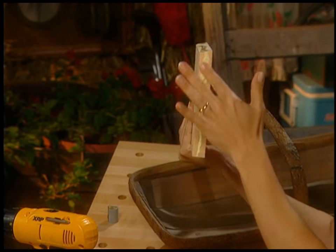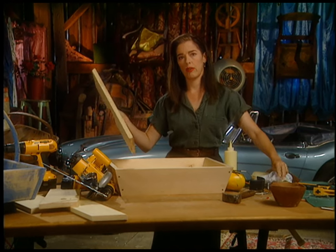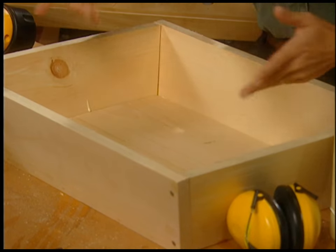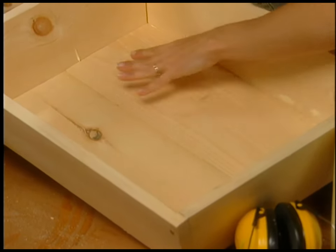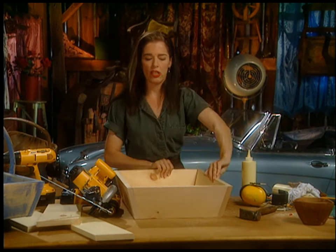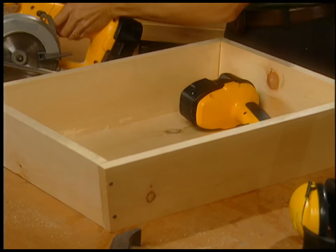Just finishing putting glue on my floor edges and I'm going to drop the floorboard in. Also, if the outside shape of your trug doesn't come out quite right, you might have to give a little chiropractic tweak. I had to do that because the floor looked like it was in crooked - see, you just go like that. Then you can just leave these sitting here. You want to check on the bottom to make sure it's relatively flush, and it's a good idea to just weight them down a little bit so that they stay connected to the edges.